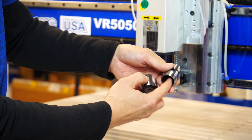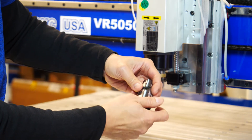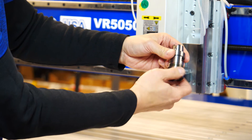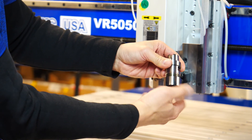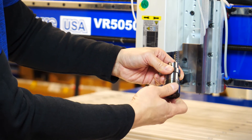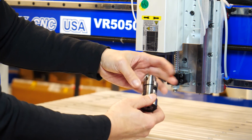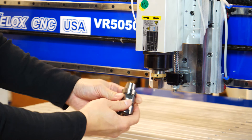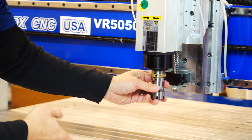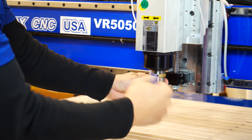The reason for that ring is so that in the event the collet gets stuck into the taper, the ring basically pulls the collet out. It'll generally take two tries. Once it's been on there for a day or a week, when you rotate this off it's going to bottom out and you'll have to rotate it again — it'll actually yank the collet out of that taper. So it has to sit flush, and match the dimple to the flathead.